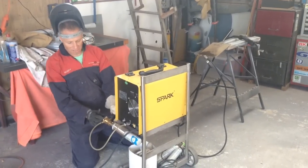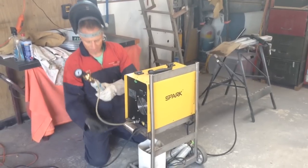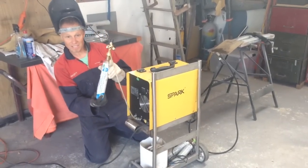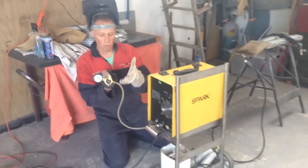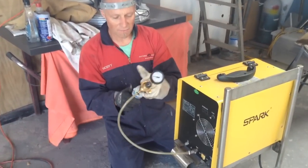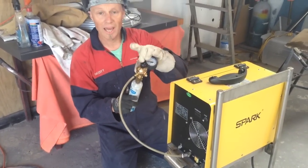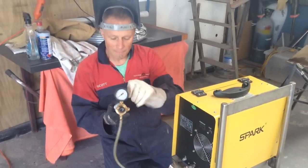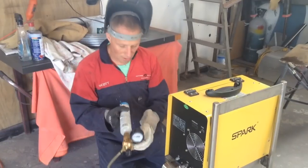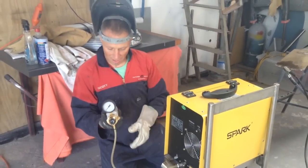This is the second regulator I've ever used. I mounted it on my trolley so it can sit vertically, because it's gas, not liquid. And this is the regulator right here. I Googled for a Sodastream or soda gas regulator for welding — it wasn't hard to find. There's no on-off valve. You wind out the regulator, wind it onto the Sodastream bottle nice and tight, then wind the regulator and boom — you've got gas coming through.